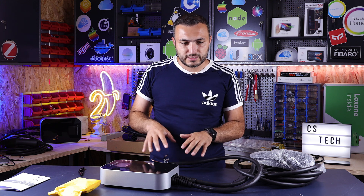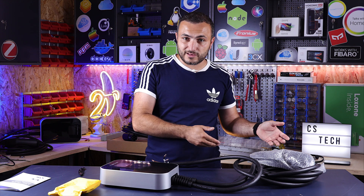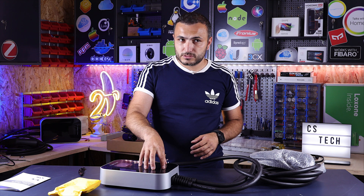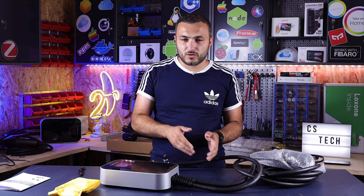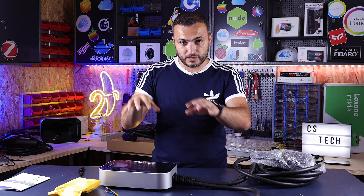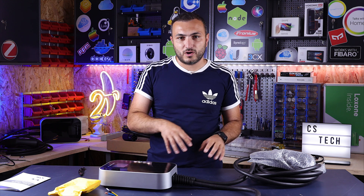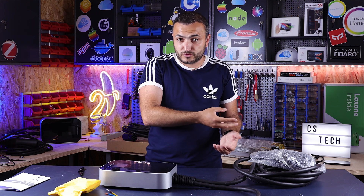This is fine for those with a small car that doesn't draw from three phases — it draws from only one phase. But of course, in the near future I will buy a Tesla and charge it with the same station. Like I said earlier, we tested this on a Tesla Model S 2019. The Tesla has a rated charger of 11kW, and the station delivered exactly 11kW. You can use this station on three-phase or single-phase connection. For those with a single-phase car but three-phase home connection, don't worry — just connect the station to the three phase, but the car and station will deliver energy on only one phase, because the car only has a single-phase connection. In both ways, this station is more than perfect for a small car and for a bigger car.